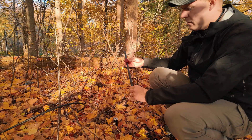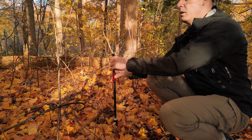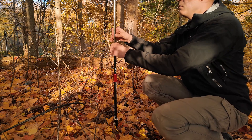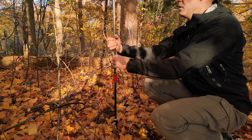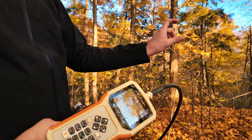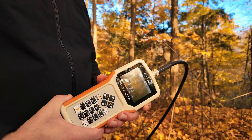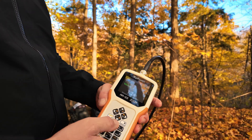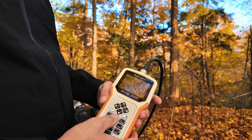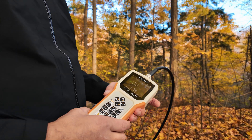Now with the radial and base setup complete, I'm just going to build the antenna itself. I have a 17 and a half foot antenna which is long enough, and I actually have to trim it down a few inches to tune the antenna. Basically what I'm doing is shortening the antenna because it's longer than needed to give it the perfect resonance. As you can see, I just started — it's at 1.2 SWR — so we'll match it up to 1.1 and then connect the cable to the radio.